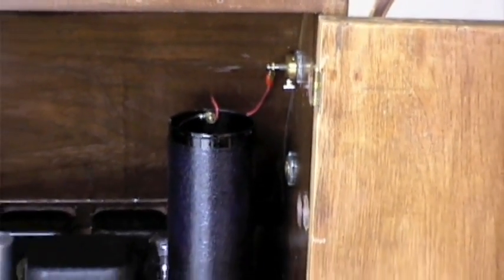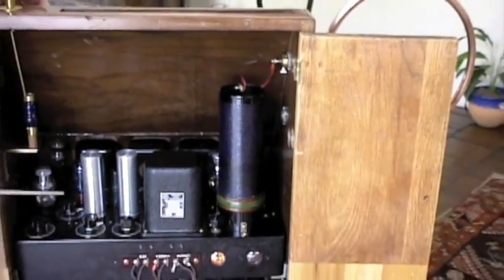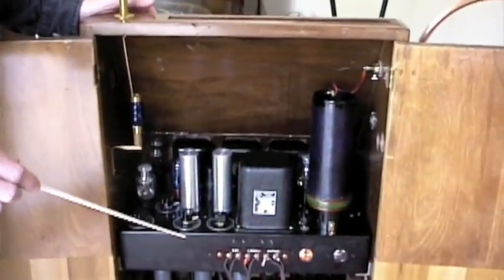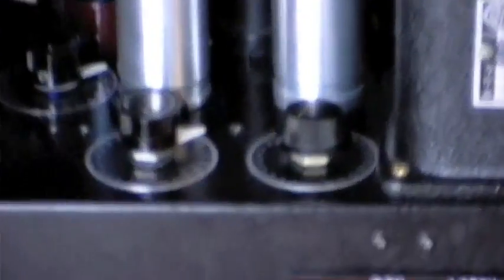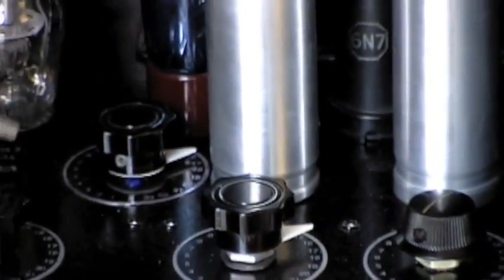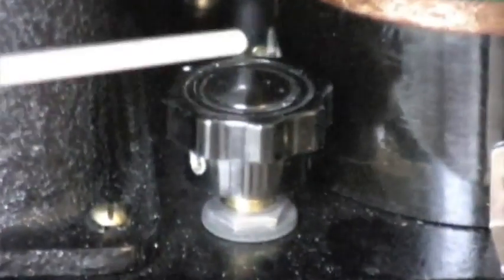All of these things are adjustable. There are many little settings here — mysterious-looking dials that aren't mysterious to me, but I think they will be if I die and don't write down their purpose. These two control tone color; this controls pitch linearity; and the pitch color in the bass is affected by this. This is a rough tuning control, and this is a tuning control for volume sensitivity. If one wants a big effect with a small movement of the volume hand, you would turn this knob slightly.